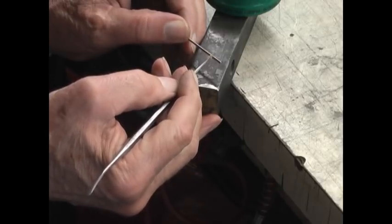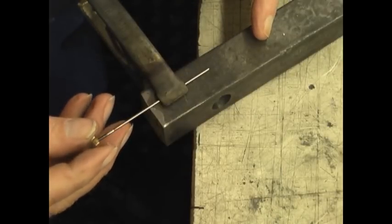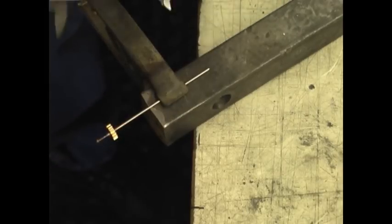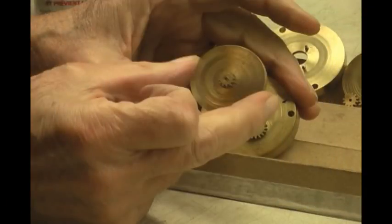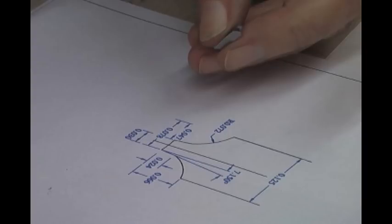Here I'm fluxing the main shaft. A sun gear will be soft soldered to one end of this shaft. Eventually, the second hand will be clamped to the other end. 2 custom high-speed steel cutters are required, one to cut the integral sun gears, one to cut the ring gears.